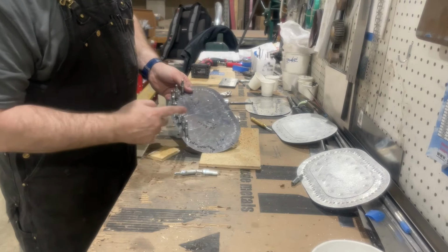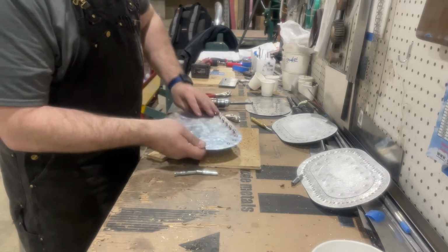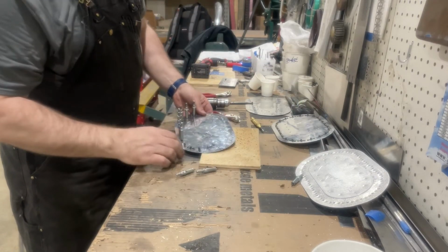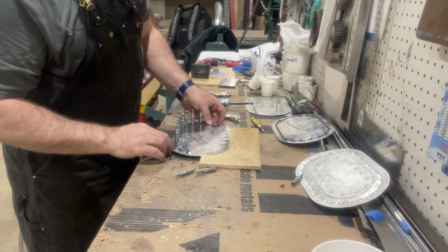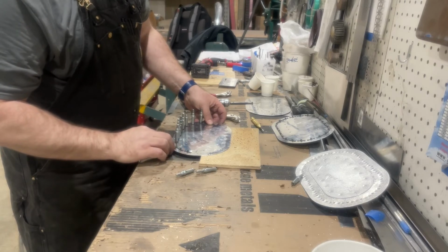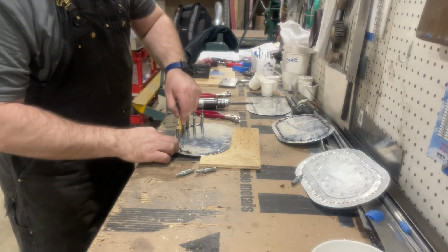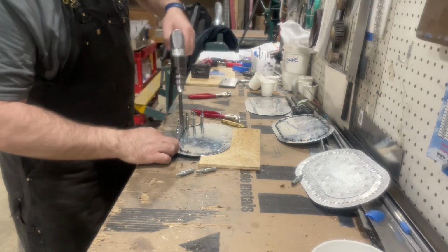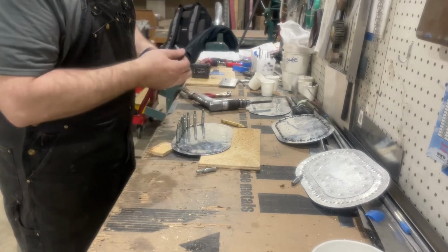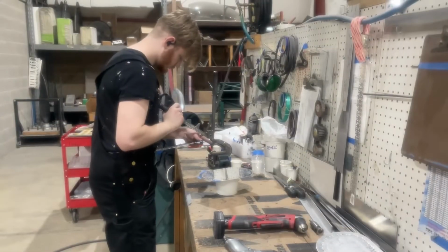Because of the two holes, I'm only doing one side around, and then I'll do the other side in reverse, and holding it so that my hole pattern is going to look nice and uniform all the way around. So I put it in place, put the backing here, rotate it, estimate about where they're going to look, where it needs to be, hold it in place on one side, center punch it, drill it, and cleco it.